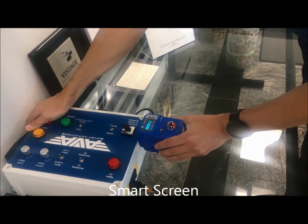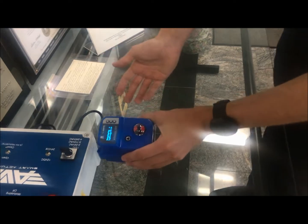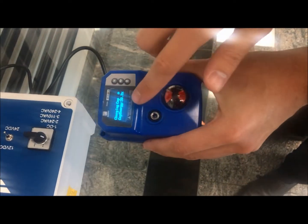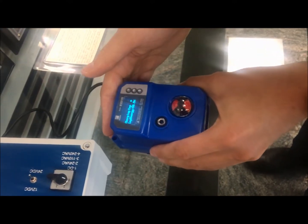If I turn this on — there we go. You can see there's a whole entire screen that illuminates when the actuator is powered on. This is a fail-safe unit, so right now it's charging its capacitor. This unit does not use lithium-ion batteries — it's completely capacitor based.